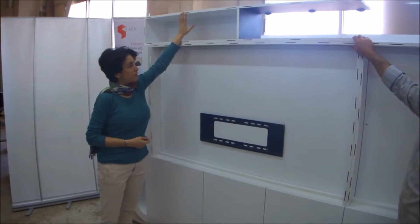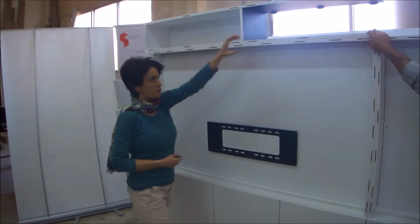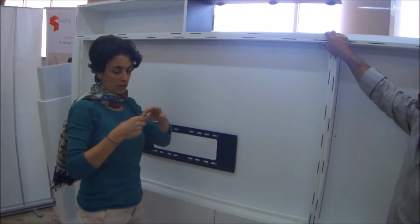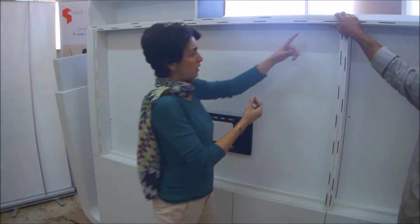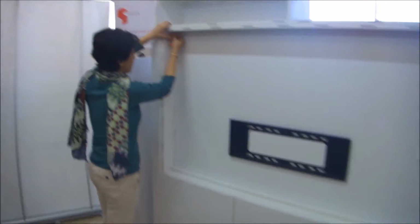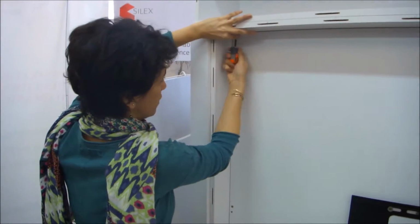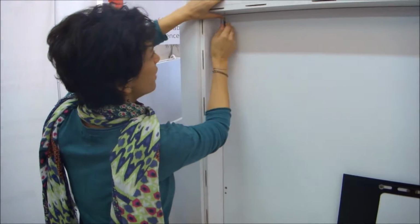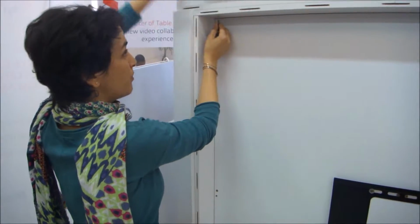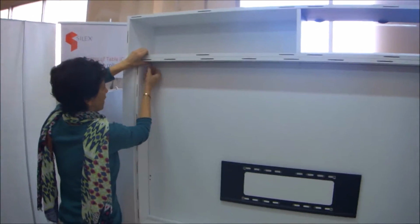Once you place the camera enclosure on top and it's well aligned from all sides, well inserted with the 2 biscuits, we need to make sure that these 2 parts are well tied together. So you have 3 small size screws to place, 1 here, 1 here, and 1 here. You place them and you tighten them very well until they reach the end, and your camera enclosure will make one part along with the panel, the video panel.